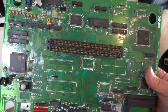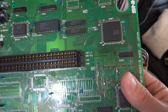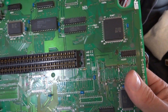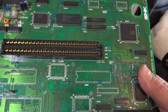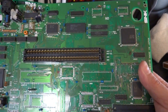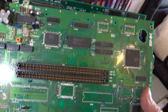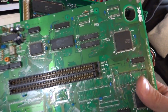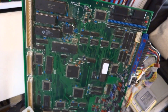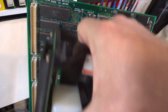Well, actually it was dead when I got it, so it's not so bad. This is one where somebody had forcibly tried to rip up the BIOS on it and left nothing but rips and traces pulled up — just huge holes. This thing was dead from the start, but it's one I've used to repair a couple of boards in the past. I actually used a couple of these RAM chips to fix other boards, so it's running low on parts. There's no telling that this Neo D0 chip was any good when I put it on here, so that could have been another problem.